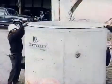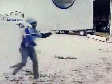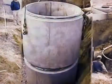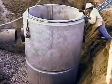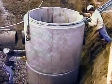A different method to equalize gasket volume is to grasp the gasket and pull it away from the spigot. Repeat this procedure around the entire rim circumference. Next, apply gasket lubricant to the gasket surface — this will help additional sections to seat more easily. Clean and lubricate the bell surface of the concrete piece to be installed. When setting an additional concrete piece onto a section with a lubricated gasket in place, be careful to align the new piece as exactly as possible and slowly allow the weight of the top section to settle onto the bottom piece. Any raising or adjusting will likely damage the gasket, resulting in a joint that will not seal properly.